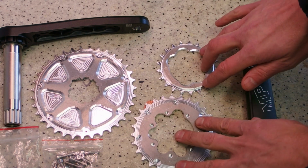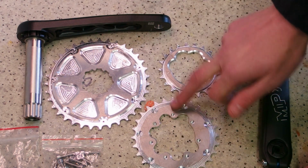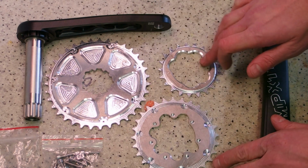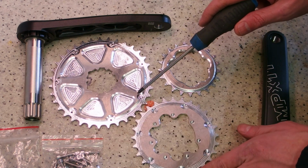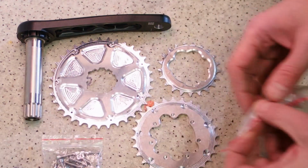7075 T6 aluminum. As I mentioned before, the sizes are 35, 28, 21, and that's not a coincidence, because the greatest common divisor of all these three sizes is 7. If you count these holes here, 1, 2, 3, 4, 5, 6, 7. There are 7 of them, and in each there's going to be a pin